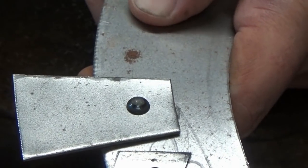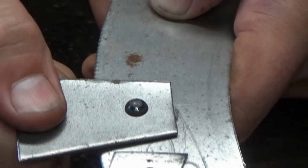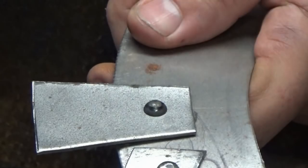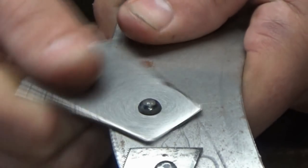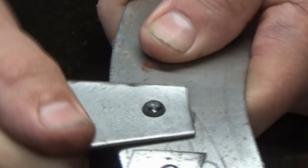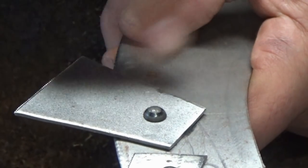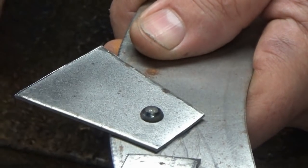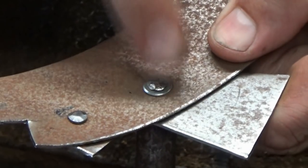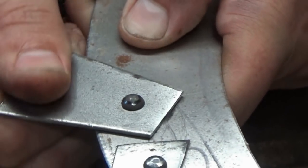So it's been riveted together — imagine this goes off to a visor and this is the side of a helmet. Depending on your period and what you're recreating, it will have a catch sometimes, or it'll just be supported under its own weight. Sometimes they have to move very freely, other times you need a stiff movement. Whichever it is, you just tighten it down to that. Sometimes you can put a bit of leather between the pieces to help with the movement — I've put leather in, I've put another washer in, I've gone without either. To be honest they always loosen off and at some point you find yourself tightening these off on the inside of the helm, but it takes just a few moments and you're back to a strong catch again.